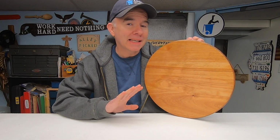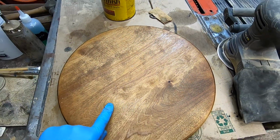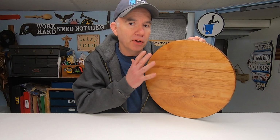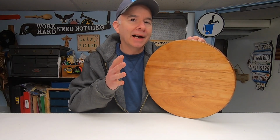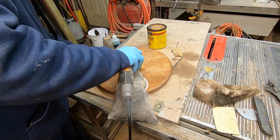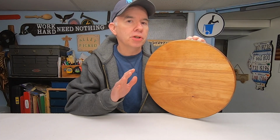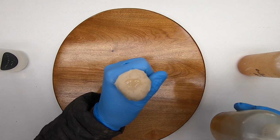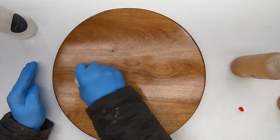It was not easy at all. At first I stained it. It was blotchy. I didn't like it, so I sanded it down. My second attempt, I used shellac to fill the pores, and then I put stain on top of that. I didn't like that either, so I sanded it down again. The third time, I used just shellac. I didn't brush it on. I used a technique called French polishing to apply many layers of shellac.